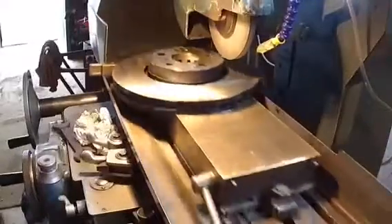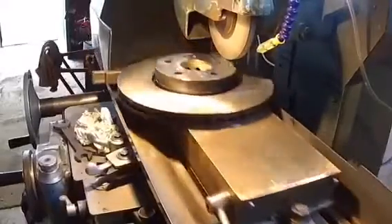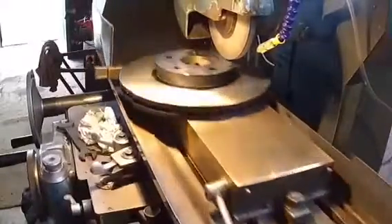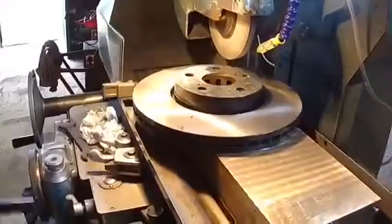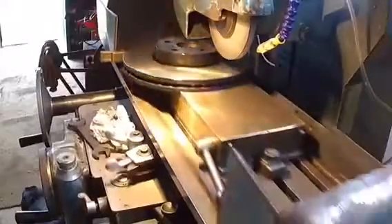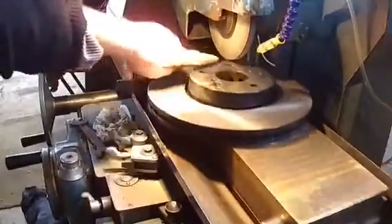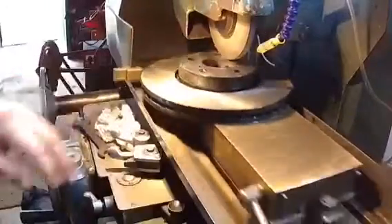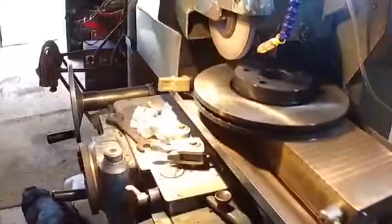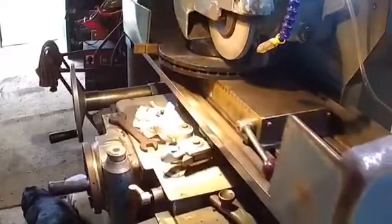There's a bit less noise now as I've turned in the panel. Just coming back now - you can see a little spark there and that's two tenths. So I'm happy at that. The compressor's running as well. I've just turned the coolant flow down the slide a little bit - still blasting it on, but not as much. As you can see it's quite a puddle here. The part's just absolutely stone cold and there's no heat in it at all, so we don't get any movement whatsoever. If you put it on the surface plate we can have a little measure around it and see where we're at.